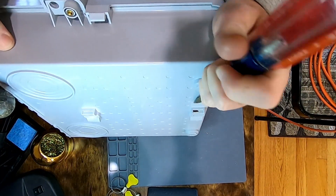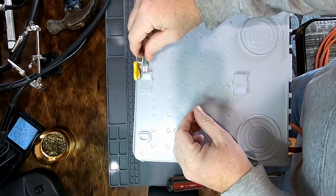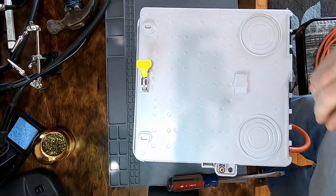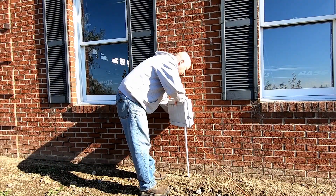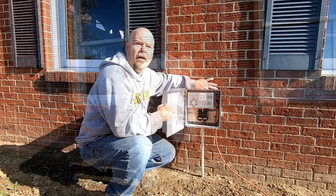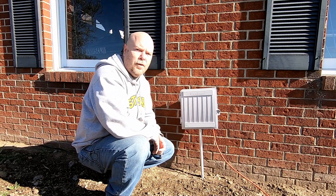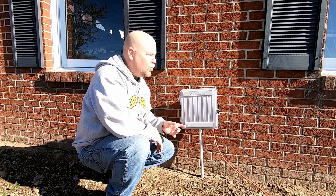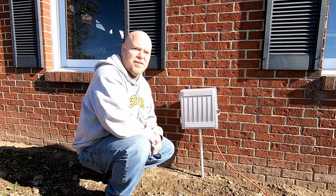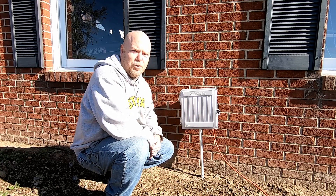There are lots of options for mounting these boxes. I'm going to use the hose clamp punch outs on the back. The only thing that's really critical is that when the box is installed, it is vertical with the entrance and exit for all the cabling on the bottom — that's the only way the thing is fully weather resistant. Once these boxes are done, they deploy pretty quickly; you'll spend most of your time untangling the power cord and taking up the slack in those hose clamps. One down, three to go. I think I'm going to step up to one inch PVC pipe to hold this thing — the half inch doesn't drive into the ground straight. But that's next time, so stick around.